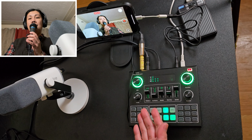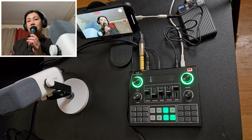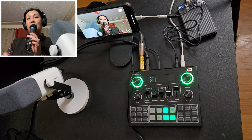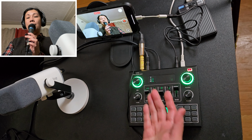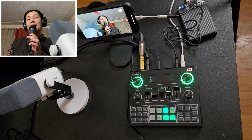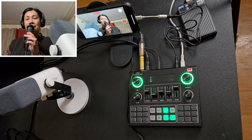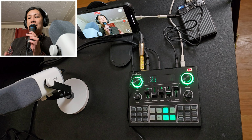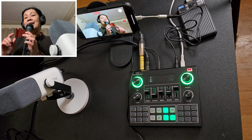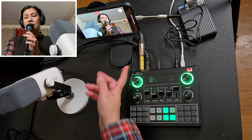as soon as you plug them in, it will work. So please note, if you are using a dynamic microphone which is, should I say, a hungry gain dynamic microphone, it will not work. Even if you use same cords, cables, mic cables that I used on here, it will not work. Because if that is the microphone that you have, you will need an inline mic preamp, like a Fethead. So I'm just giving you a heads up. That could be the reason why your dynamic microphone might not work, even if you use same cables and adapter that I've shown you here, this one here.